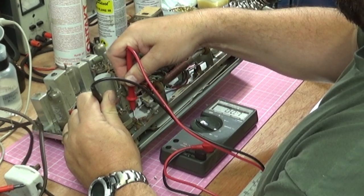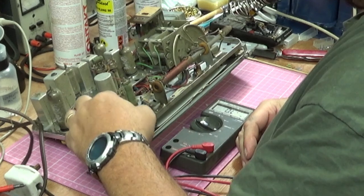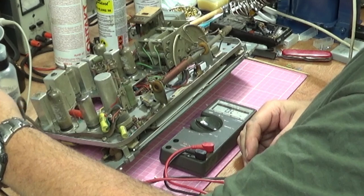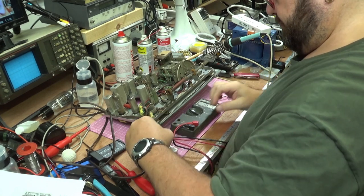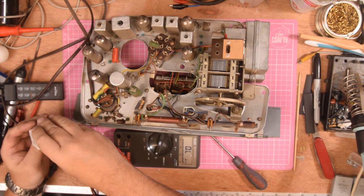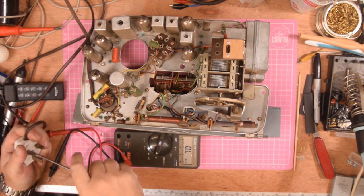It is the neutral side — the black side. So because we've got a color-coded switch and a color-coded mains cord, let's just have a quick look inside the mains plug to confirm it is actually wired correctly — and it is. You have the red wire going to the fuse and the black wire going to the neutral side, so it is actually wired safely. It's one of those things you can never take a chance with — you have to test it.